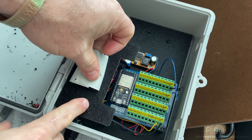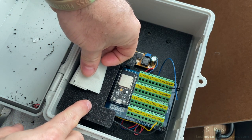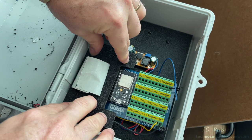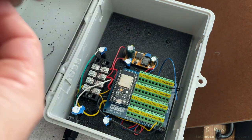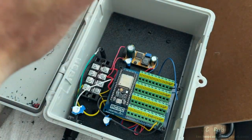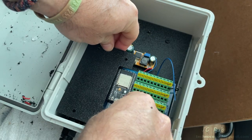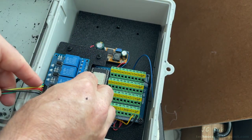Using the same technique, I make a handle, get the right location for the plastic piece I've cut out, and press it down to mark exactly where I have to drill. I press each individual one to ensure the mark is good, then lift off. Now I can remove the tape with the paint on it without wasting any parts. The holes are drilled and this piece should line up — the quad relay board for the solenoids will go right here.